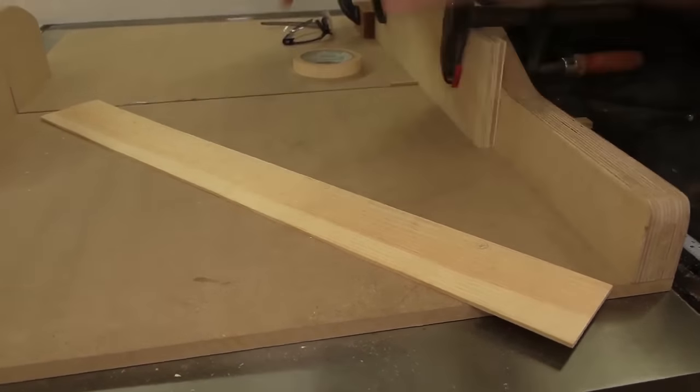And for this, I'm just gonna use a slip match and it matches up quite well. So then on the ends, you can see you end up with a beautiful quarter sawn board that it'll be hard to see the seams after this is glued up. So this gets glued up and then run through the drum sander, or you could even hand plane it after that point. Pine is a pleasure to plane. And you're gonna have beautiful quarter sawn material.